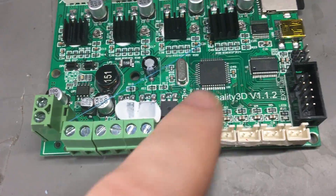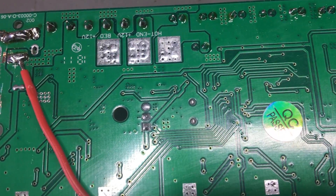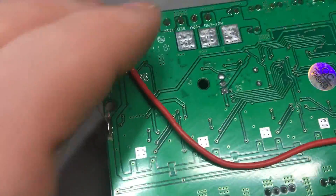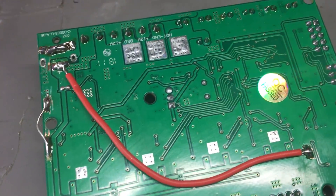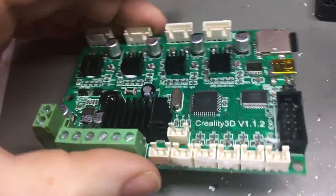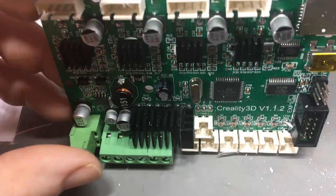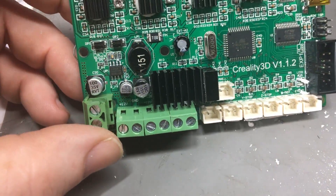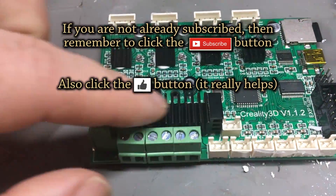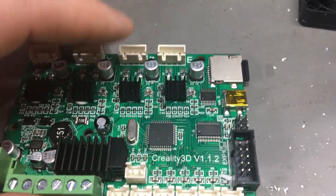The only thing I noticed is that you've got two fan connectors here - fan and fan 1. What I want to do is wire up the main internal fan, which happens to be a 24-volt fan, and wire that straight across the supply so it's running all the time - you don't want it to overheat. I've glued the heatsink back on again. I've got an adhesive heatsink stuck onto the end and moved it along a little bit so it's now completely covering the MOSFETs, and the whole thing is glued all the way down across the top. So they're all definitely going to get cooling now.